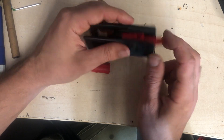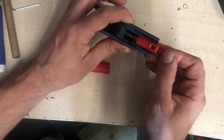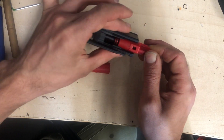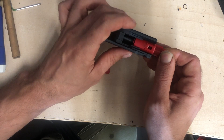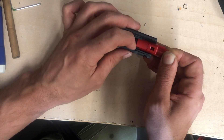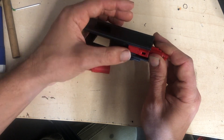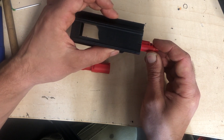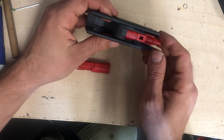Will this also affect performance by making it travel a little bit less? It should not really be the case, because there was just a little bit of extra travel to give the bolt a little more momentum. The pressure building is already cut off at that point, so there's no real force behind the nozzle anymore — it should be more or less the same. It may drag the bolt a little bit sooner, but it should be relatively not a big deal.